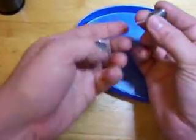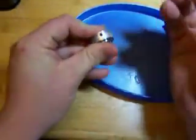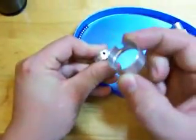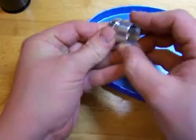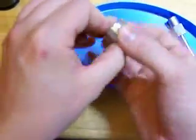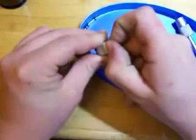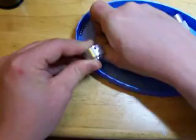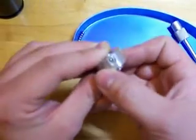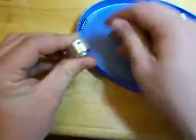First of all, we have to reinstall the center plunger into the gas lock. Then, as you see in here, there's a slight indentation around which fits around there neatly. Now as you see, this ring covers all the holes bar the one you're currently working on. Now it's important that we have all 8 locking systems, for I have run one before with 7. It's not really recommended. The trick to do here is to load the ball bearings into each hole.